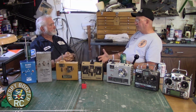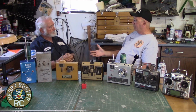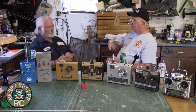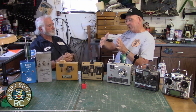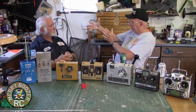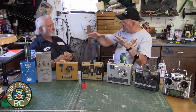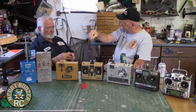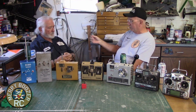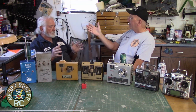So now what you're doing to build is you'd have a flat table like this, and what I built on was an old ceiling tile. Yeah, for a small airplane, and you couldn't do that on a larger airplane. Or you put two tiles and you start getting your table longer. I remember building a quarter of the wing, then putting it together. But you put that plan down, and you put your spars, and you'd use pins. Or magnets. I remember when we got really fancy, where you were able to put the magnets in between to hold them. And then hold your ribs up and your spars through.